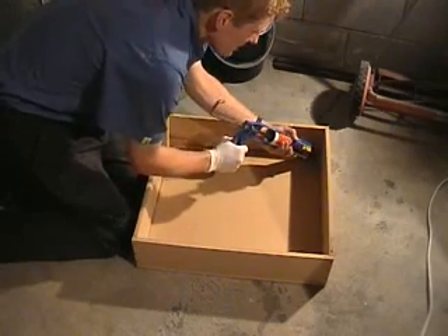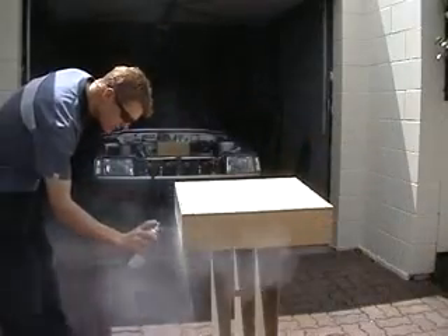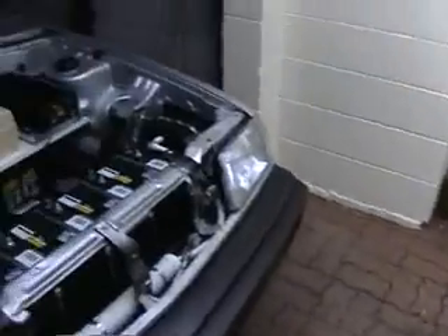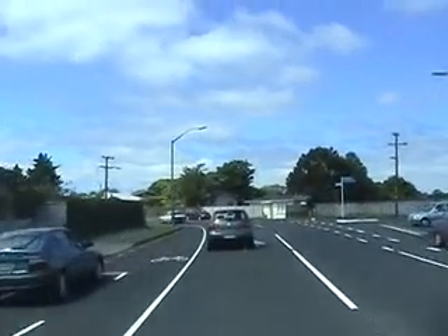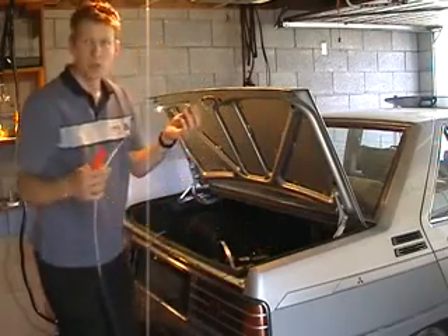The gas will instead go out through the ventilation system I will install very soon. I am now putting the same flame retardant paint on the inside of the top half of the box. Now I have the strapping in place, I am just going to install the box on top of it. I am off to the hardware store to get some flexible pipe that will protect the steel strapping from damaging the batteries. Just got back with some clear PVC tubing which I will use to protect the batteries.